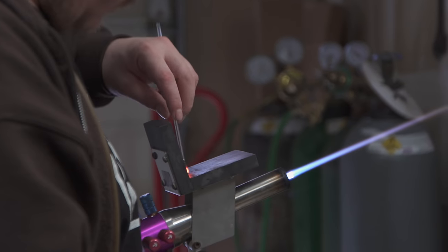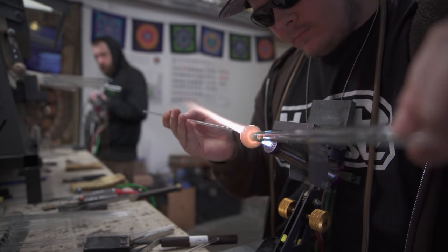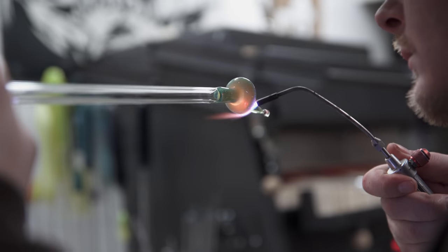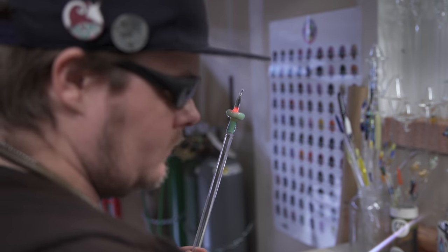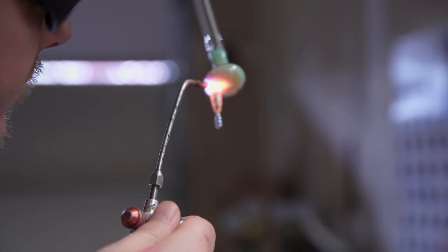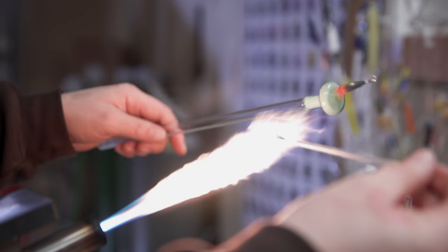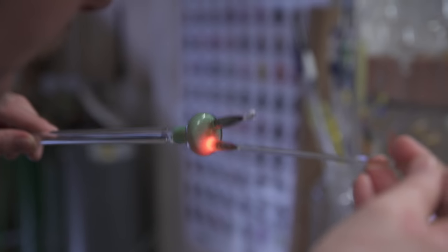And we're going to go in and place our first horn just over the edge of the shoulder of that disc. Not dead center, but right around the side there. Going in with our hand torch. This one won't be bridged up, so you've got to go a little slower so it doesn't droop around on you. Get that second horn preheated and stuck on there, and just eyeball all these arrangements. Muscle memory is kind of a big play on this, but after a few tries, it shouldn't be that hard.